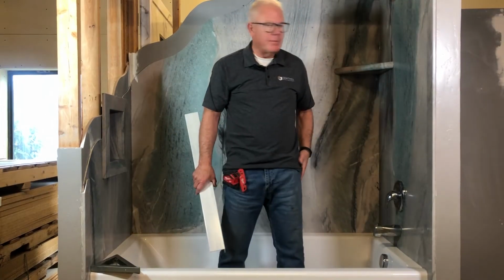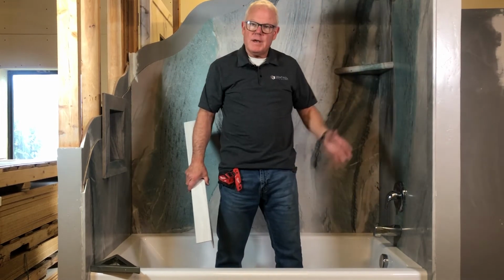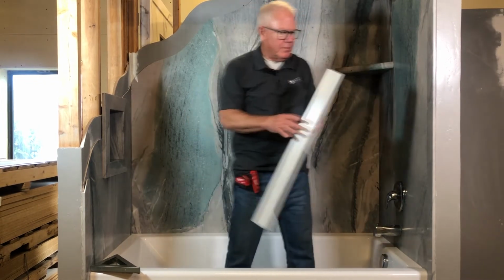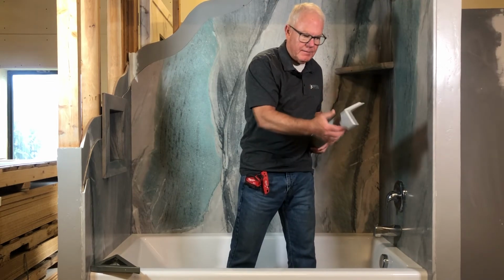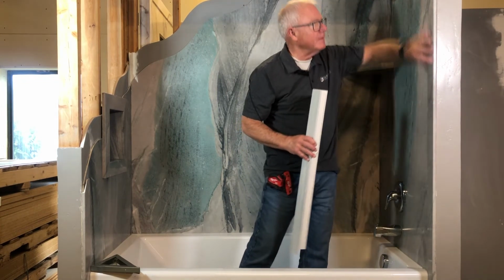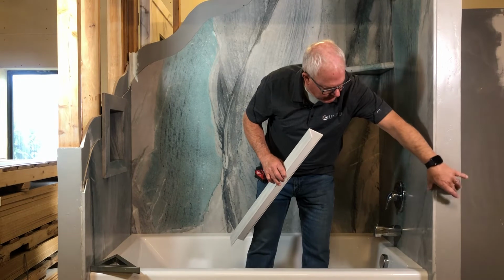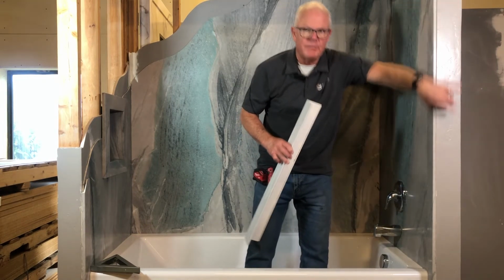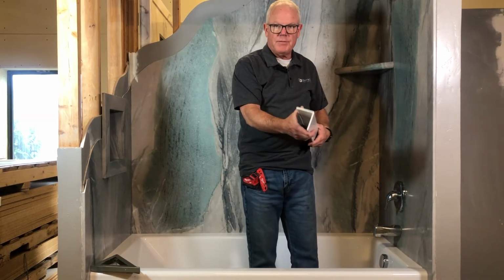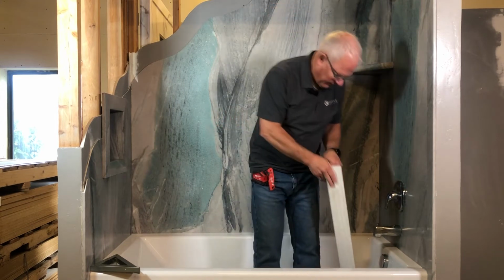If you're ever in a project where this outside wall is not good and you want to cover it up, you can replace this trim with this double edge trim, and it's a complete corner wrap. That way you still get this look and match your look all the way around, but you're also able to go clear out in here and hide any imperfections in the sheetrock wall, whether it's over here or over there. This 3" by 3" outside corner is a wonderful thing to have on hand for most projects. Okay, good.